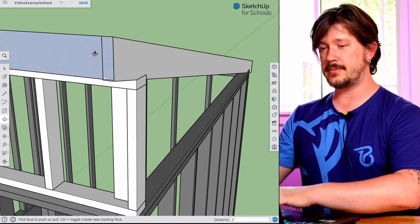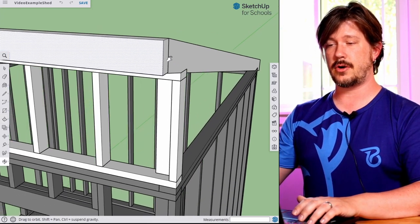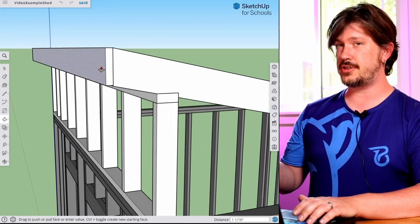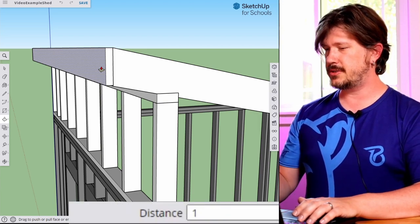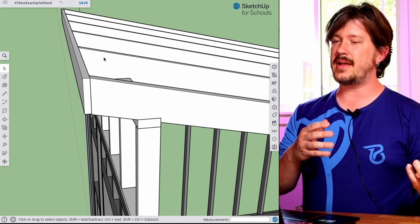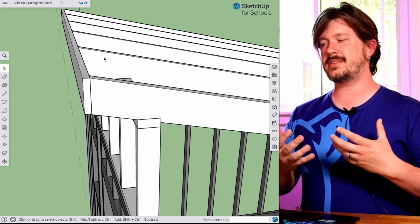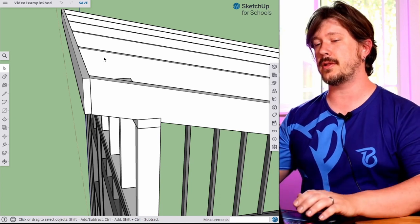A lot of times though, people will use whatever material they're gonna use for their trim. So if you're getting some trim that's pre-made, you're probably looking at an inch thick trim, between 3/4 to 1 inch. So let's do 1 inch. And that is going to help just tie everything together. It will help hold your rafters in place a little bit, but it's also meant to make things look a little cleaner, like you have a more solid roof.